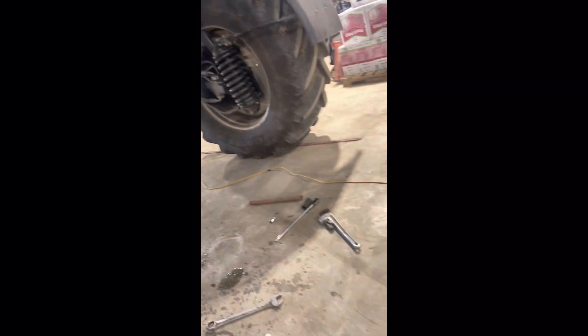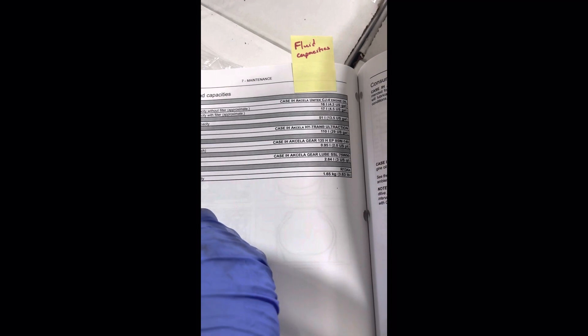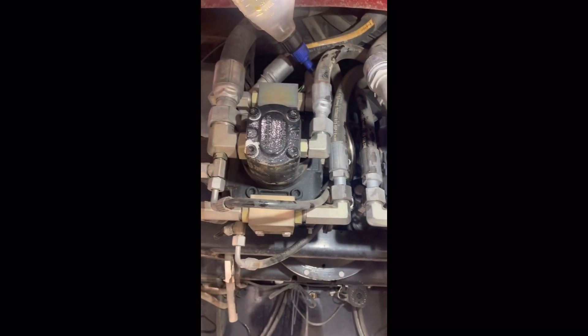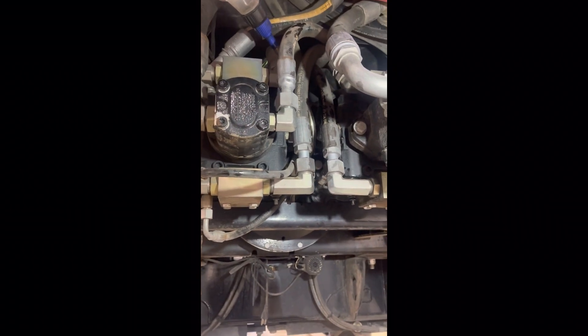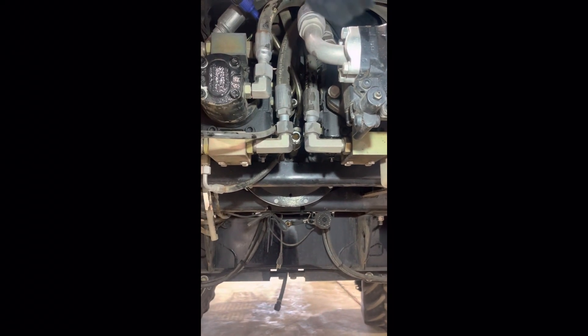It took the full three quarts. I looked in the book and it is the gear increaser — three US quarts. From up in here is where I'll put the plug back in, but it's still tight for room. Because you can't run it straight through, it's still not ideal, but it works better than filling through the breather hose. If you're just doing it once a year depending on the hours you put on your sprayer, it's somewhat of a fix, and I had all the fittings just lying around on the farm so it didn't cost anything.